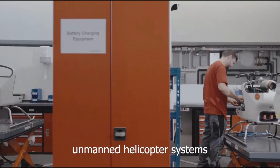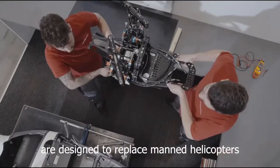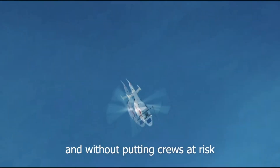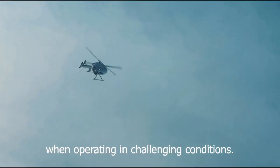This may be a stupid question, but why don't those two propellers just rip each other apart once this thing gets going? The two rotors are mechanically locked at 90 degrees phase shifted, so they cannot touch each other unless there's a mechanical failure inside. Well, let's hope that remains true!